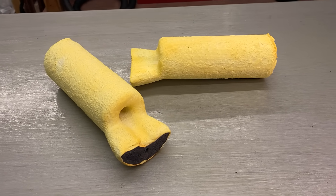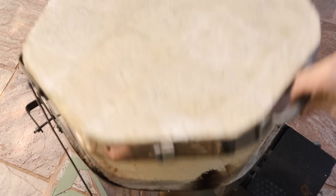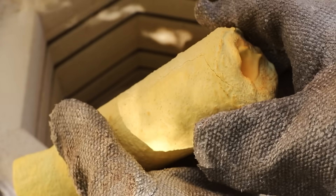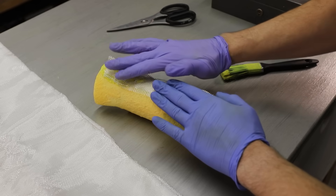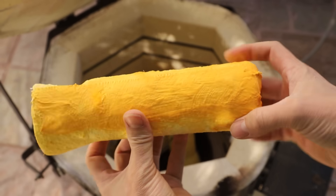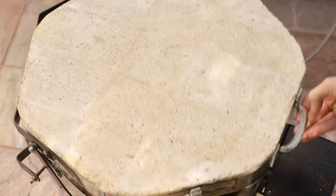With the shells nice and dry, I placed them inside my kiln and started to burn out the plastic. Oddly, at about 200°F, one of the shells cracked really badly, but the other one was totally fine. I had to fix the crack, so I let it cool down and patched it with some slurry and fiberglass cloth. I was able to get the shell fixed and back into the kiln in about 45 minutes. Now all I can do is hope that the repair holds and bring up the temperature to the melting point of the PLA and let it flow out of the shells.